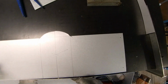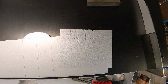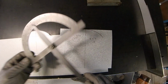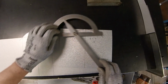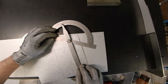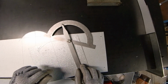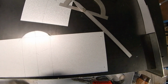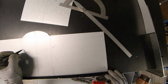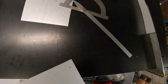Now if you want to know how many degrees we have to bend it, I always as a standard bend those flattenings 90 degrees, but if you have a degree ruler, so this should be, well, here we see 56 degree bending. 56 degrees, but we always bend a little bit more, so it's 60 degrees that we're going to bend. Therefore, we go to the bending machine.